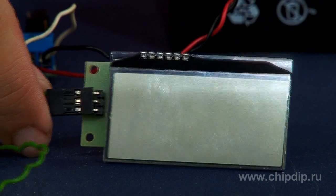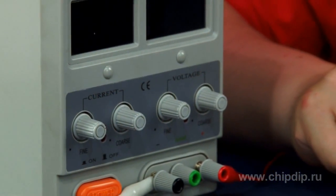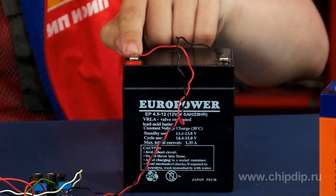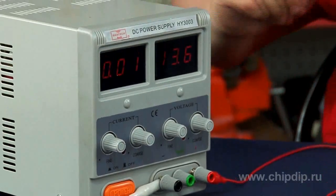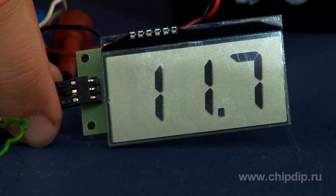For more complete control of device operation, you can use a voltmeter. For example, we use digital voltmeter SVL0002 from the same series as our module SCD0011. For the power supply unit, we use a laboratory power supply source. We assembled the appliance according to a schematic, connected the output contacts to the rechargeable battery — positive to positive, negative to negative — and applied voltage from the laboratory unit to observe the charging process.